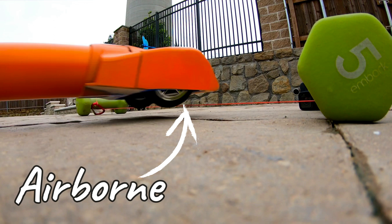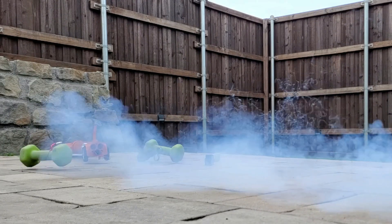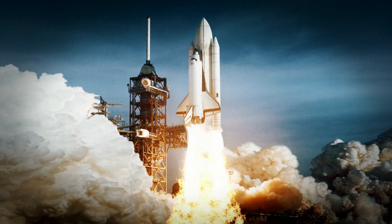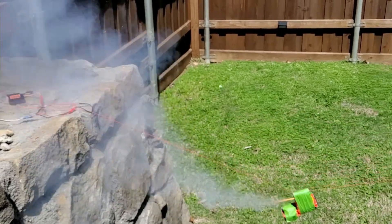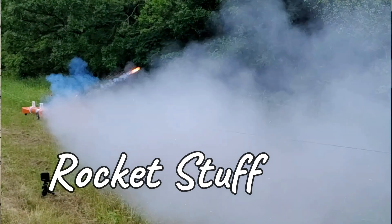I don't feel safe going with a cluster of high powered rockets as-is. There's no front suspension and no weight, which means the front end pops up on the smallest bumps — which is incredibly bad with this much thrust because it'll turn into an uncontrollable rocket. You cannot steer a car that's airborne. The middle section was a clear tube to give maximum wheelbase because that helps with pitch sensitivity from an aerodynamic loading perspective, but when you have a ton of thrust, it's not just aerodynamic forces that matter — the thrust itself can lift you into the air. The braking system relies on perfect timing, can fail at high speeds, the car can go straight under the catch line, and the brake occasionally jams. This wouldn't be allowed in any competition — you can't stop the ignition once started, and if the brakes fail, you just have to hold on for dear life. The car also randomly launches rocket propellant. So it's time to admit I need to redesign this thing.